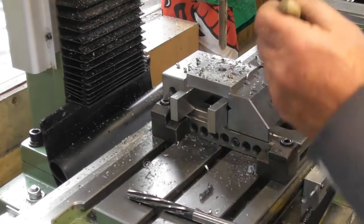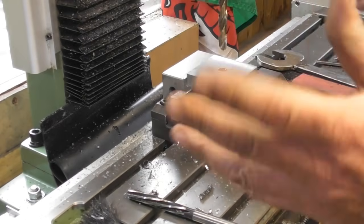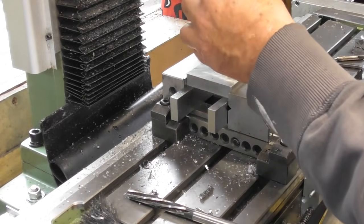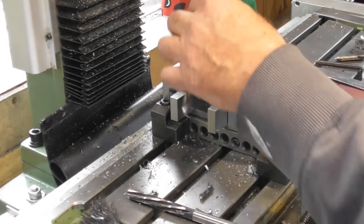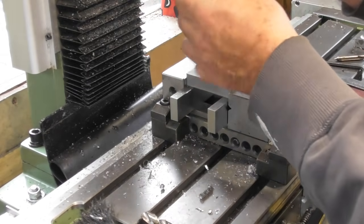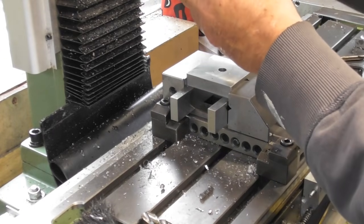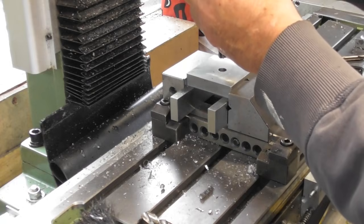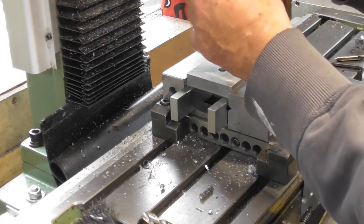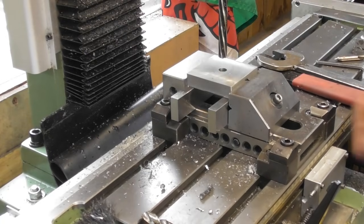Without measuring the bolts on James's lathe to know the exact diameter, I'd imagine it's a threaded stud or bolt. It's going to be under 10 millimeters nominal, marginally. So my plan being that if I put a 10 mil reamed hole, it isn't going to be oversized as such, like it would be if I put a 10 mil drill through. So yeah.